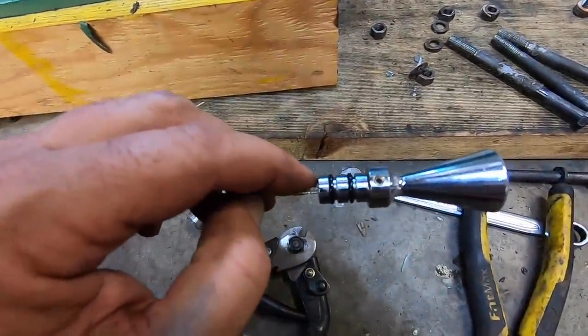Other people were saying don't trust the factory dipstick either. Look, it's probably good advice. You know, I won't cut it now. According to the factory dipstick, it needs to be an inch shorter, but I will just fill it with the factory amount, run it so that the pumps and galleries fill, let it drain back down in the sump pan for a while, check the level and mark it as that.